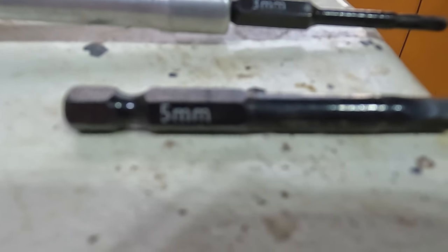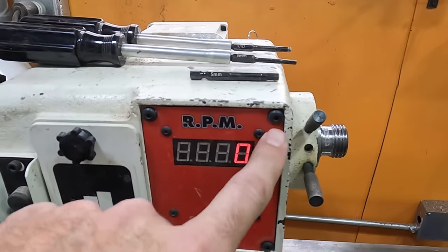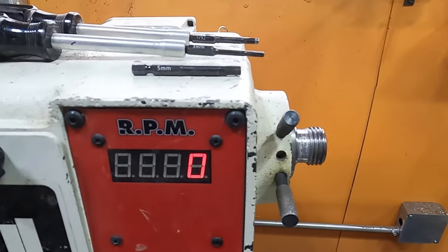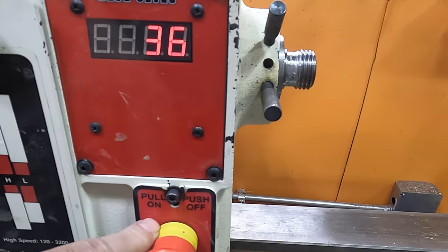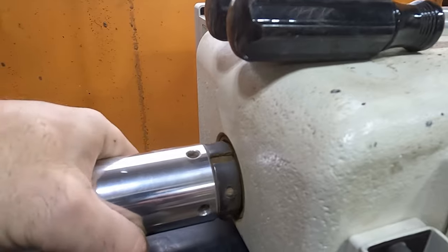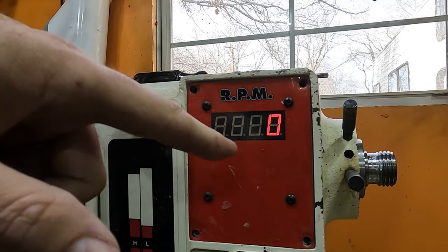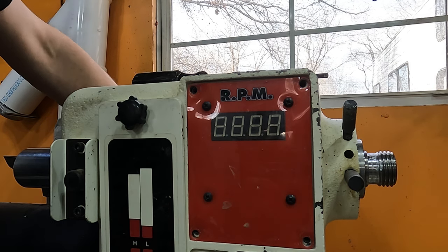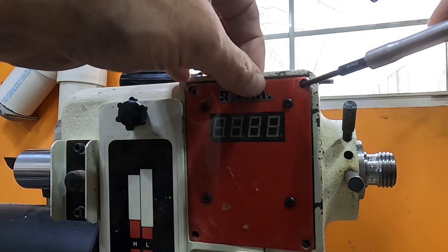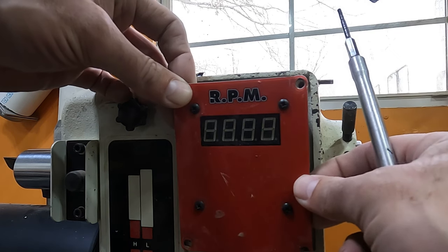Some of the main tools we'll be using today are a five millimeter hex head bit, a three millimeter, and a 5/32 bit — that'll take out a lot of these screws. We can remove the digital readout, but want to be careful on the back of this, there is an optical eye that reads the RPM on the headstock. Before I get into any of this, I'm going to unplug everything — we don't want it to accidentally come on. Safety is paramount, so if you're going to work on your lathe or any other heavy equipment, make sure you unplug everything. Just be very careful with that optical eye; you don't want to get any dirt on it or the RPMs won't read properly.